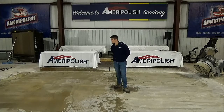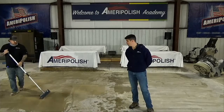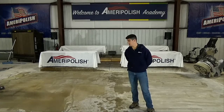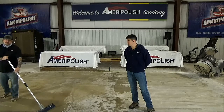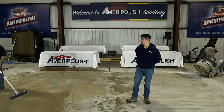Now, one thing we did not bring up yet, and we should have already, but we recommend using the Mohs hardness test before your first cut and after your first cut. That's just an indicator. We recommend anything over a 3.5 with our system. If it's lower than a 3.5, then you might have to densify your floor to harden it up before you get on it. We just found that works the best and gives you the best floor possible.